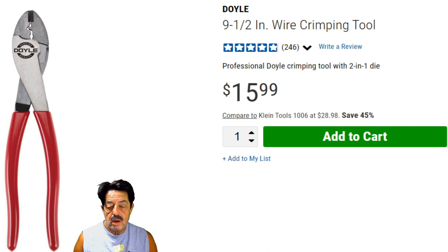Now, there was a comment in the forum when I posted this where somebody said that over time the cutters on these start to dull, and you can't really use them that much anymore. Use a diamond file. You can sharpen them. Diamond files are available on Amazon. I'll try to leave you a link below. That's where I got mine. Or you can get them at the big box stores, though they tend to be cheaper online. All you have to do is lightly file these, and you'll get that sharpness right back. So that doesn't make them a bad pair or something to complain about. This is a damn good value at that price.